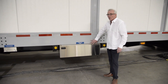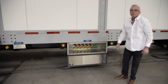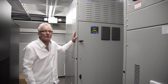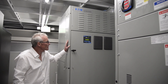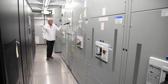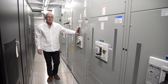We've also equipped our trailer for the critical load output in a stainless steel cam lock setup. These are also female cam locks, capable of providing six conductors per phase plus ground. Our trailers come equipped with a 2000 amp Eaton automatic transfer switch — these are bypass isolation switches, three-pole open transition. These are pre-wired from the cam lock boxes. We have an integrated Eaton switchgear lineup rated at 2000 amps, 100% rated, consisting of our main input breaker, UPS input breaker, maintenance bypass breaker — which is key switched for safety.